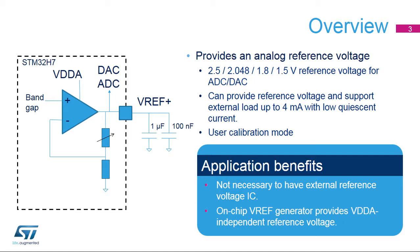Applications can benefit from this on-chip voltage reference as it eliminates the need for an expensive external stand-alone reference voltage IC. For space-constrained systems, it is common to use the analog supply as the reference voltage. By using this VREF buffer instead, it can create a stable voltage even if the analog supply is changing — for example, when the VDDA supply comes from a battery output.